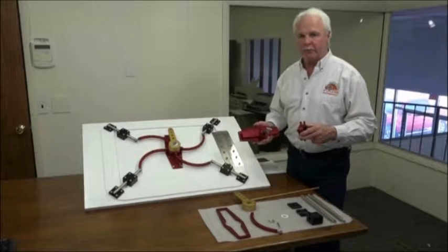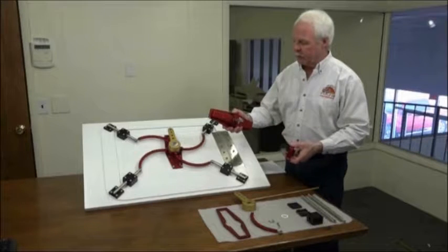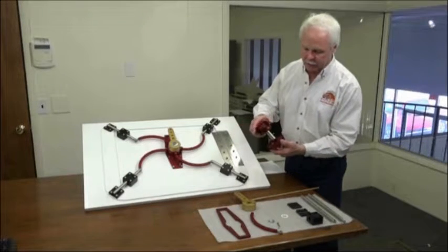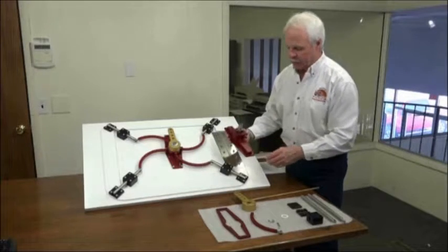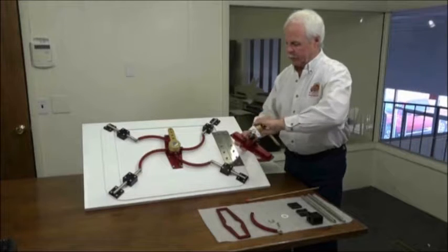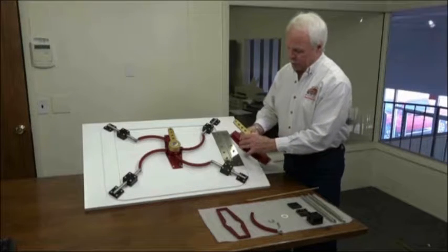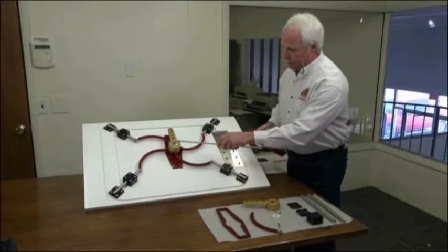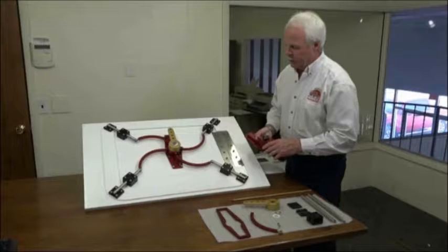To install the assembly, you'll notice there's a locating pin on the bottom of the link ring, which fits into a 90-degree curved groove on the handle housing. First insert the link ring — there are notches for the cross pin to fit into the slot. Then take the spring. The handle can be oriented in any 90-degree position. With pressure on the back side, compress the handle, then install the nylon washer and the C-clip. You would also tighten down the four socket head cap screws, which sandwich everything together, and that completes that step.